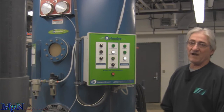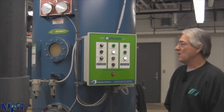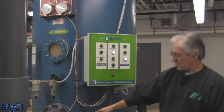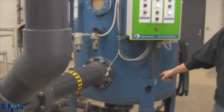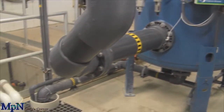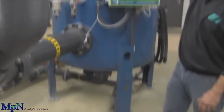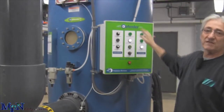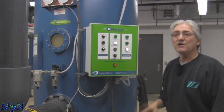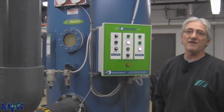While this is regenerating right now — periodically when you do have to dump the media — you're going to go through the same bump cycle. After you get done, you're going to open up a drain valve at the bottom of the filter and it runs to the sewer. After you've drained it out, you'll go through the cycle of starting the pump back up. It will fill the tank back up to the top. You shut the pump back off, hit the bump cycle again, and it will shake it back up with fresh water in. You do that a couple of times, draining it out into the sewer, discharging all of that product.